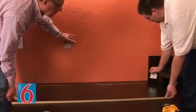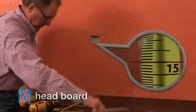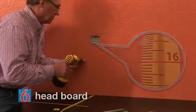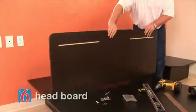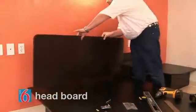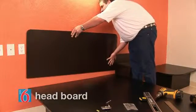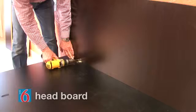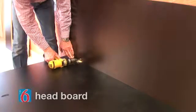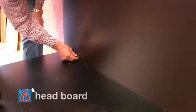Place the headboard above the platform deck and align the edges with the platform deck. Locate and level the two metal hanger plates approximately 16 inches from the platform deck to the bottom of the hanger plate, to align with the horizontal groove on the back of the headboard. Attach the plates four to six inches from the edge of the headboard using the number 8 by 2 inch flat head screws. Place the headboard onto the hanger plates so that it sets into the groove. Secure the bottom of the headboard with the number 10 by 3 inch flat head screws by locating a stud in the wall. Cover the screws with the vinyl dots to complete the installation.